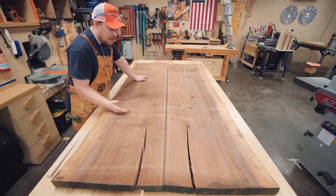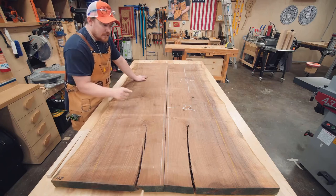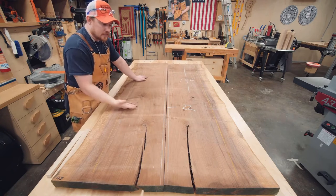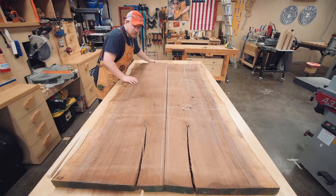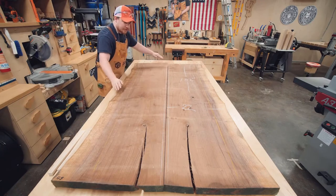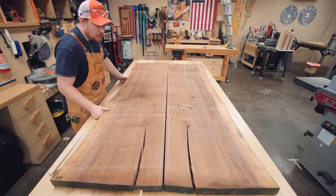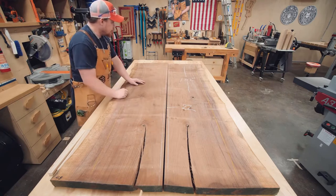Now we've got to figure out the order of our operations. The biggest problem we have to cross is these not being perfectly flat in their rough state - that's an obvious statement, but we have a little bit of twist here. This has about a half inch of twist - if I push this down, that corner will rise up. So we want to mill this flat on at least one surface before gluing up, because we can use that surface to get a nice perpendicular cut at the seam and glue them together nice and neat.